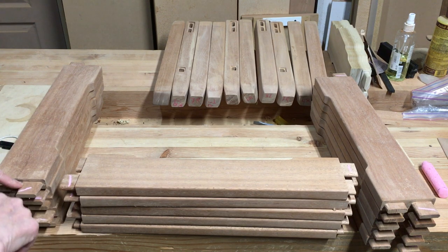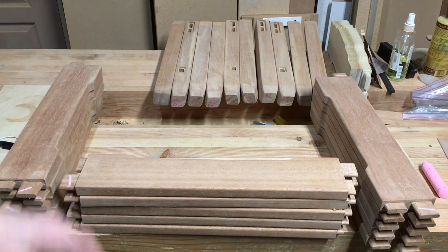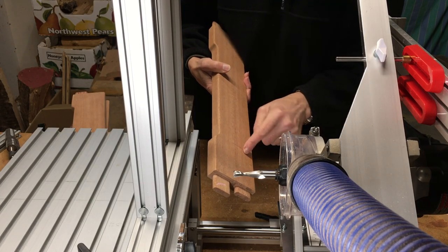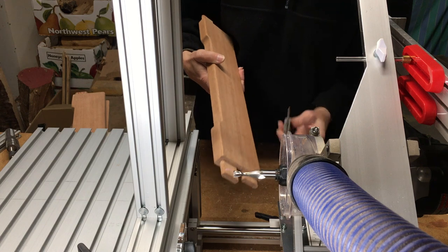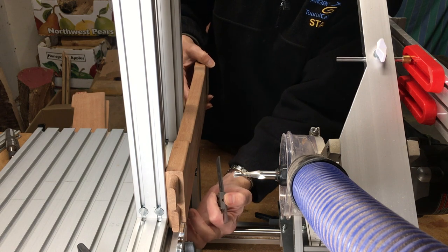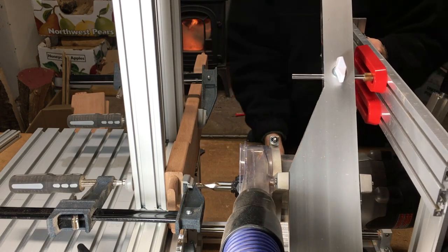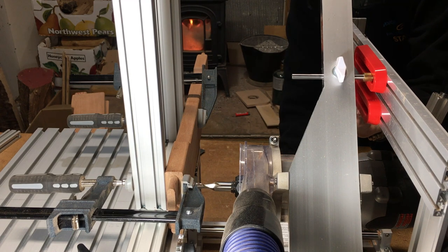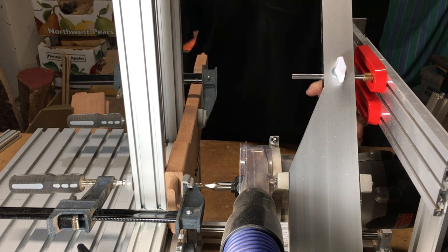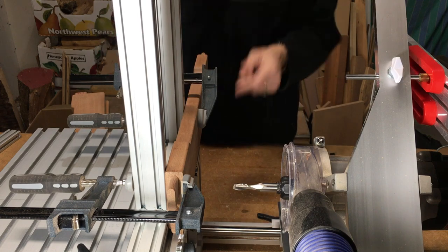I have a pink mark on the inside on the tenon so that I'm not marking on my chair face or any surface that shows — that'll help me do things in an orderly fashion. I'm about to put in the mortises for my front pieces. Each of those is 2 and 3 sixteenths of an inch from the edge. Rather than having to line up the center every time, I've put a stop that I can just set each piece into. The depth I want is 3 eighths of an inch — just a smidge more. These are 7 eighths of an inch deep, so 3 eighths is a little less than half the depth, which should be just fine.